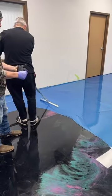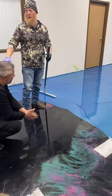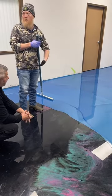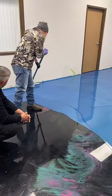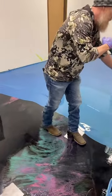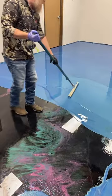Here, I'm going to stop you really quick there. So we don't need it. I don't care at all if this epoxy gets here. It doesn't matter. Because if this is big, low spots and wonky spots, there's no reason to move forward. So let's stay out here and not be impatient. Look at this. Look how smooth. You can get a lot of practice out here too. See how easy that is? And see how I fixed that thin spot there?